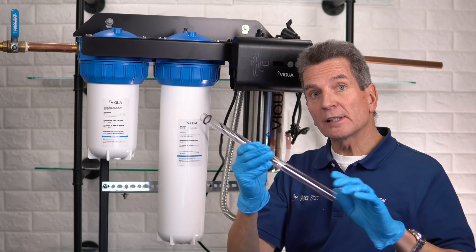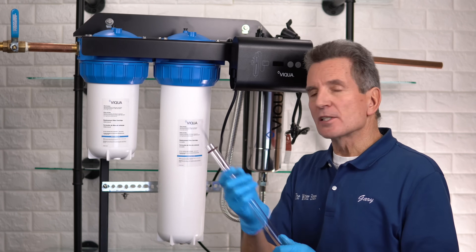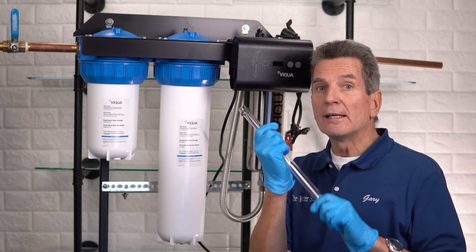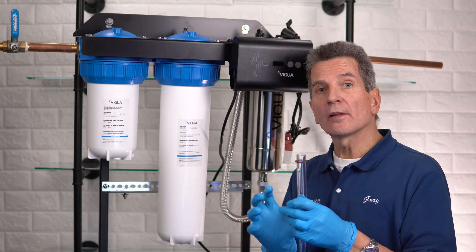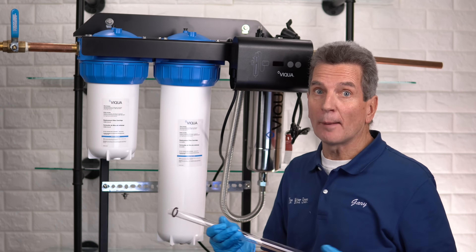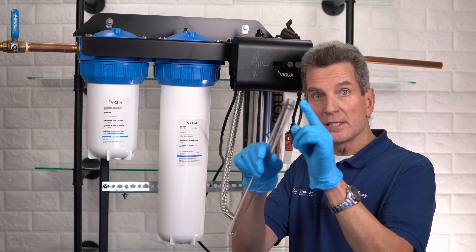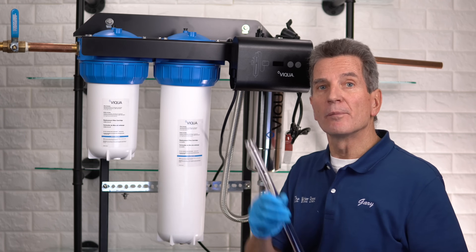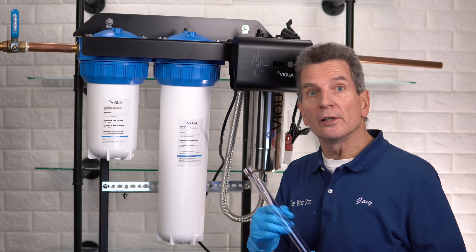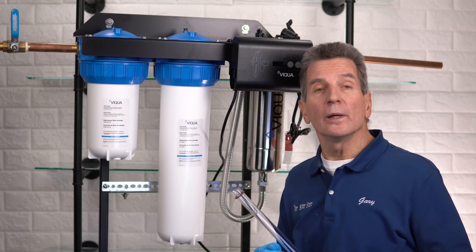You need to make sure the sleeve is perfectly clean — it needs to look just like a new one. Using CLR or vinegar, soak a clean cloth and go over the whole surface — use a soft cloth so you don't scratch it. If that doesn't clean it, soak a cloth in the solution, wrap it around the sleeve, and leave it overnight. That's another reason to always have a spare quartz sleeve on hand. The ends are easily cracked or broken, so handle it carefully. If you can't get it 100% clean, you'll need to replace it — there's no use putting in a new lamp if the sleeve is so dirty the lamp can't shine through to kill the bacteria. It's like drawing a curtain across a light.